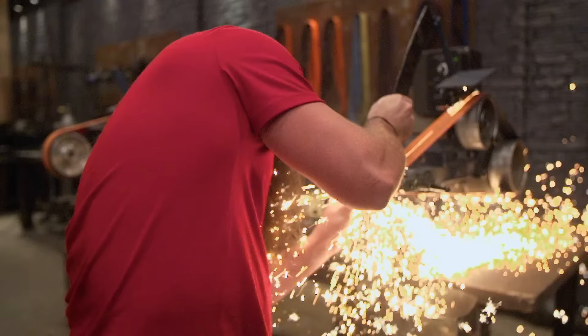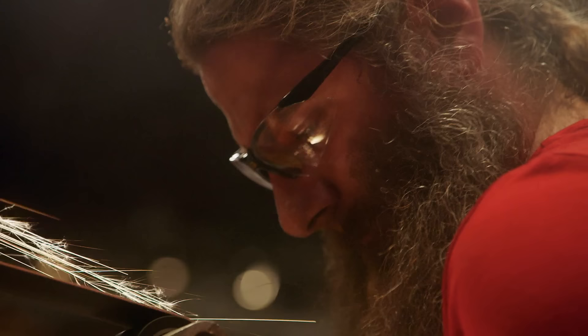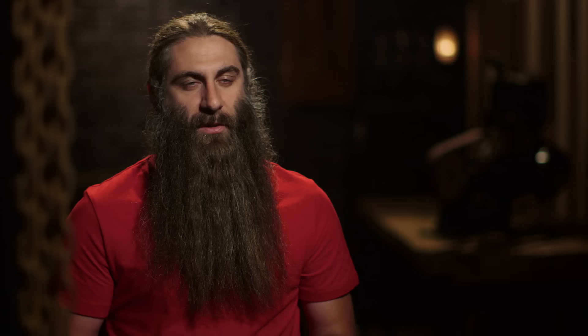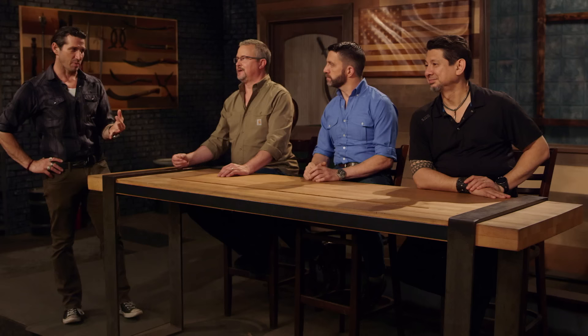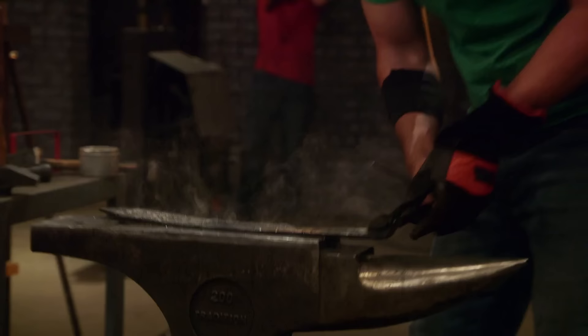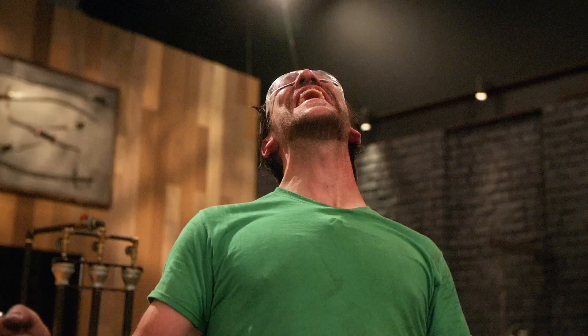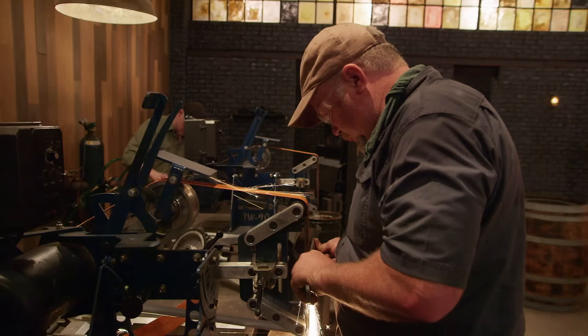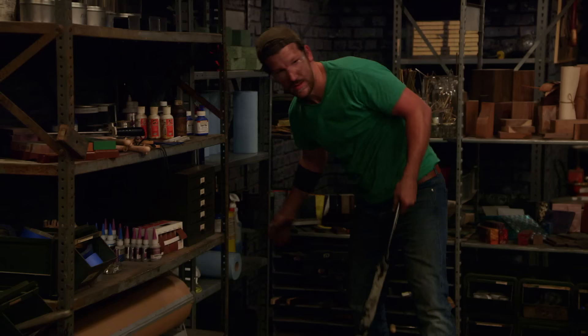30 minutes remaining! My strong suit's the grinder — once I got the billet made out, it really doesn't take me very long to get it into at least a knife shape. The thing that bothers me is Spicy Mike didn't really forge a blade; he just drew out the bar and now he's grinding it — to me, this is stock removal. To me this is the most efficient way to get something relatively blade-shaped in the shortest amount of time. Colleen kept it pretty simple on the tang — just a big rectangle. There's a slight warp, but I'm pretty sure I can grind that out. Five, four, three, two, one. Blade smiths, shut down your machines, drop your tools. This first round of super champion competition is over.